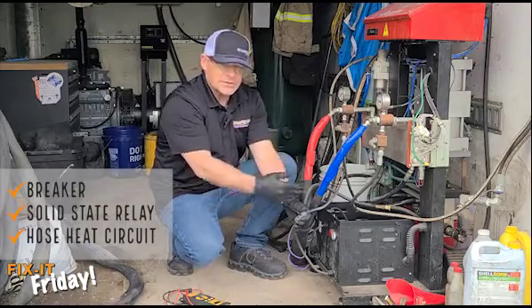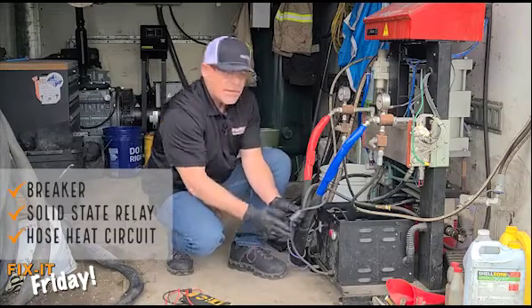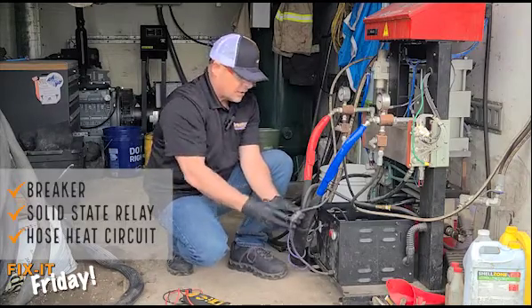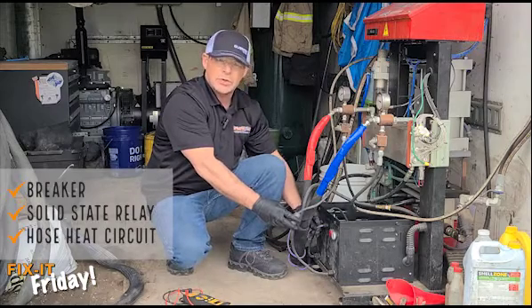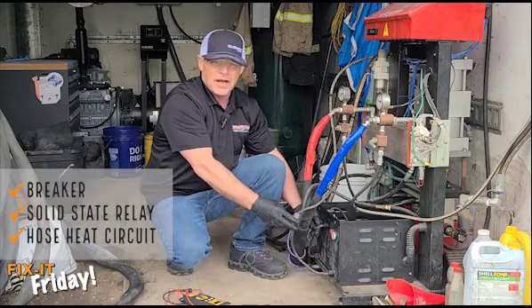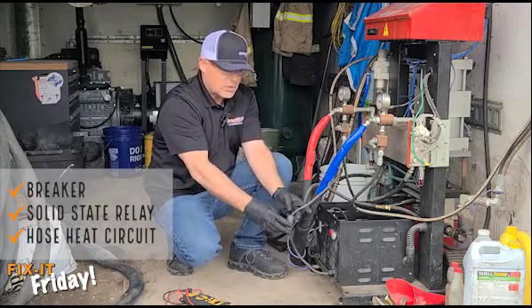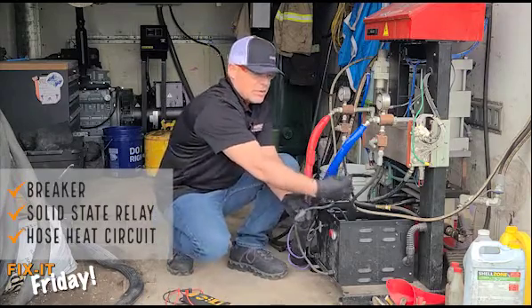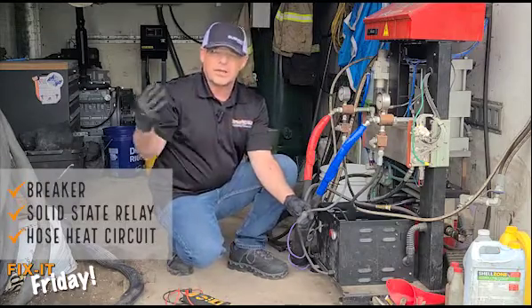You'll have the bullet connectors — these are the first ones off the transformer. You'll see these black lines coming out the front; these are your voltage lines. Don't get this confused with the purple wire — the purple wire is a communication wire, not a high voltage line. Just the two black cords going into the hoses are what runs up through the element and heats your system.